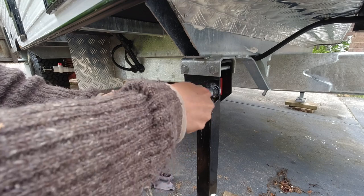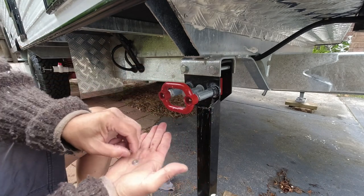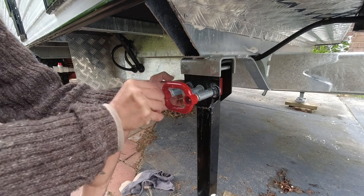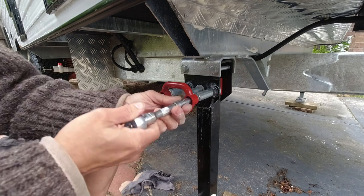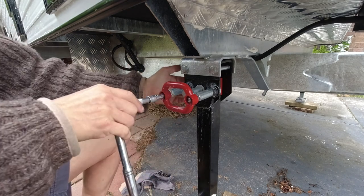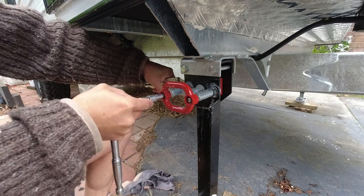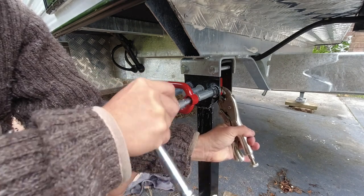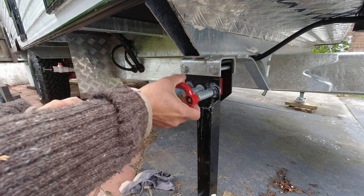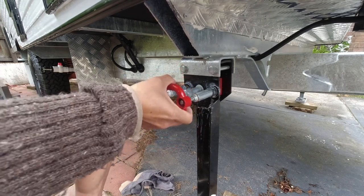As long as I can't hand loosen it, that's good enough. Put the steel washer back in on both sides. Put the red handle back. Washer and nylon nut on the left hand side — hand tighten. Washer and nylon nut for the right hand side. Now I use my 8mm socket to tighten. I put my hand on the rear stud to check it's not turning; when it begins to turn, I'll use pliers to grip it so I can continue tightening the lock nut at the front. As soon as the bolt protrudes to the edge of the nut, I stop. Now to check the pull — very good, it's moving freely and returning freely into position. That's good, it's fixed.